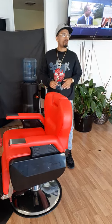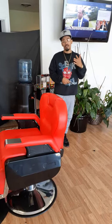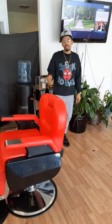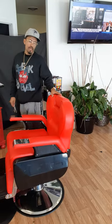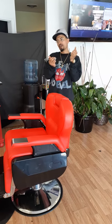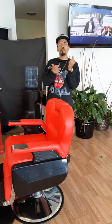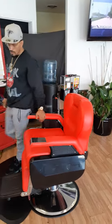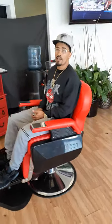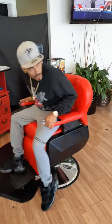You might have ordered some barber chairs and didn't know that you had to put them together yourself. You thought they were going to come already put together, but no, you have to do it yourself. With this particular chair, the manufacturer — the way they had the lever and the gas rod under it — the pin was jammed in too tight. So every time someone would sit down, it would recline without you pulling on the lever.